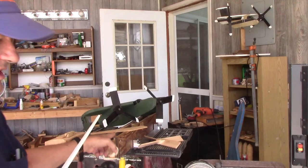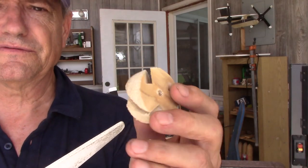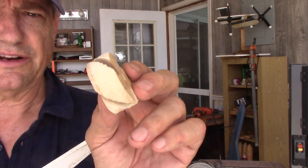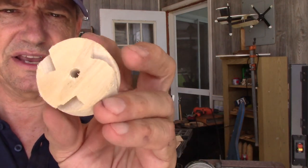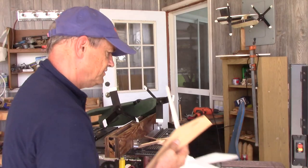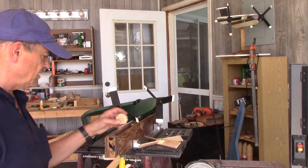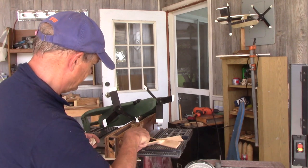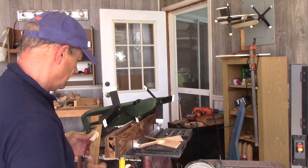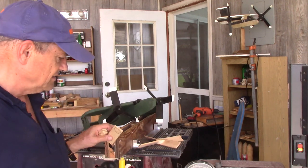There's the wind turbine — that's a three-blade hub. When I put two of these red 40-tooth saw blades together with two pieces of saltine-box cardboard between them, I get a 3/16" slot. I'm looking for 3/16" in that setup. When I tear this setup down and do other cuts, I want to be able to put it right back and accurately dial in the right thickness, and I can do that with these screws.